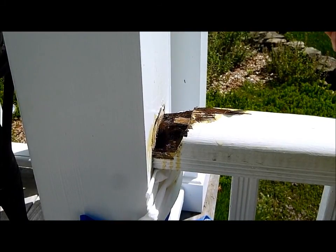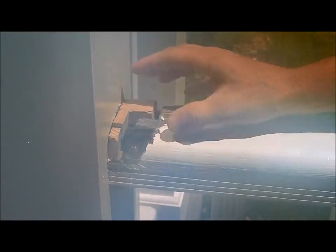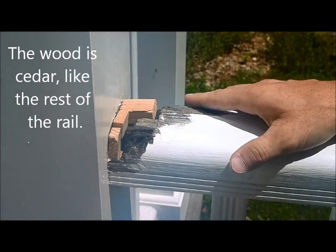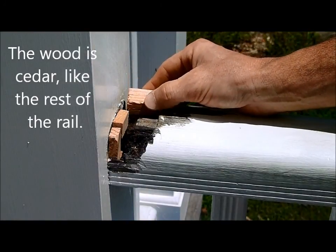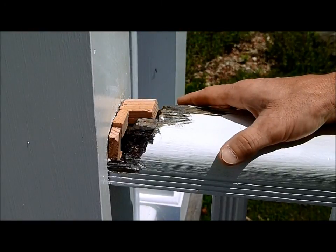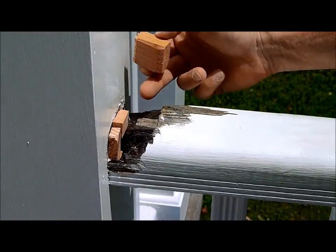I've let this dry for a bit and it dries to a crusty surface — that's good to go. I've fitted some small pieces of wood in here because we're filling this in with the high-performance wood filler, and with so much area to fill, the wood gives it structure and makes it quicker. Arguably the wood will expand and contract at a different rate than the filler, but in practice I've found that's really not an issue.